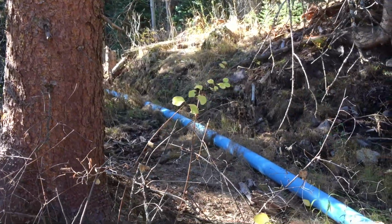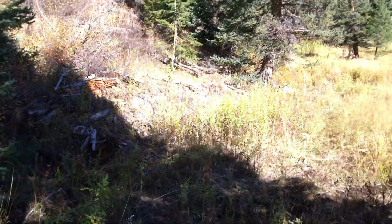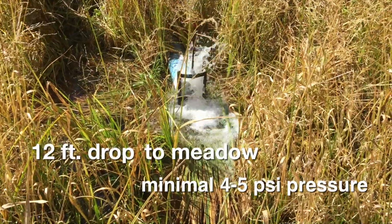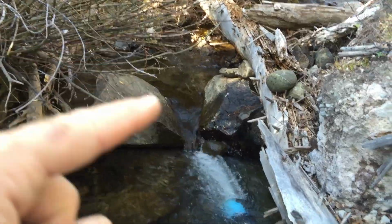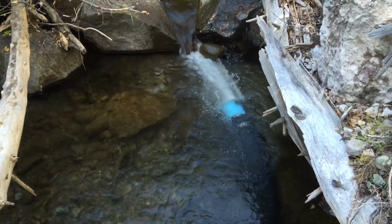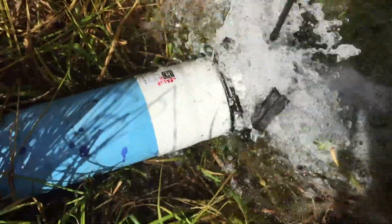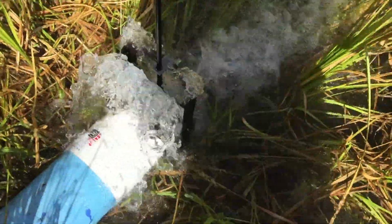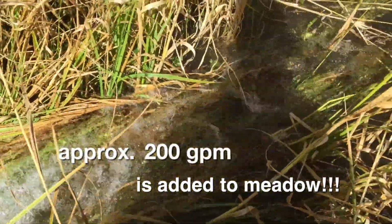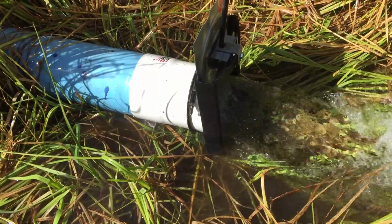We allowed some water from the intake level to flow down to the grade into the lower pipe in the meadow. When the water had reached adequate pressure at the outlet end, we submerged the intake end into the pool below the intake point to prevent any intake of air. After closing the air vent screw, we opened the irrigation gate, effectively creating a siphon. Finally, after years of planning and executing, we had all the excess water we needed in the meadow.